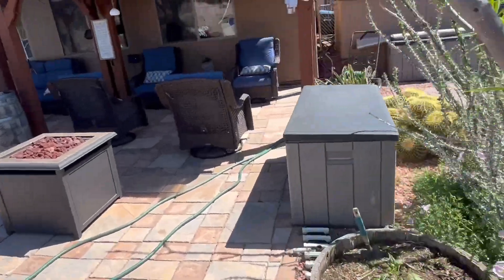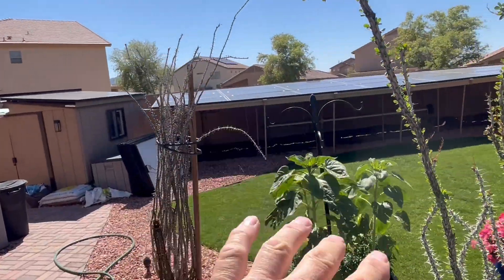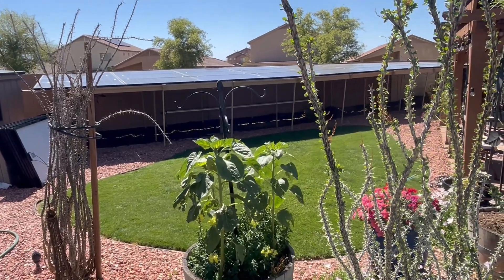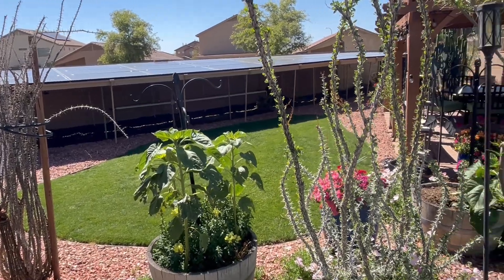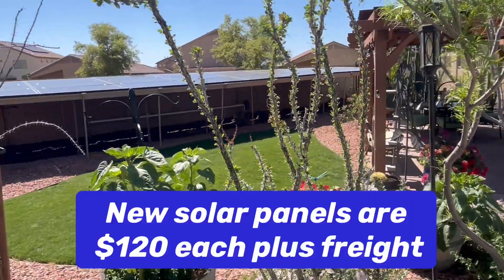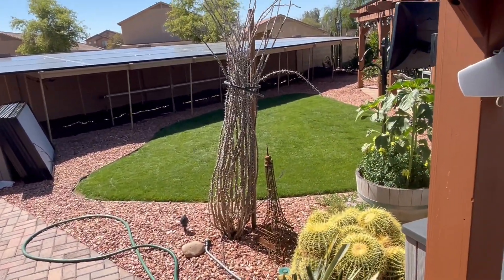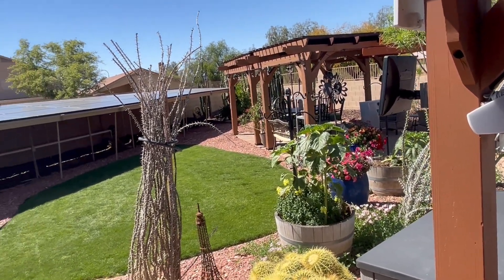Really liking those new bifacials. The used panels I bought over the years were anywhere from $25 to $40 a piece. One of the problems I'm having is water intrusion in them after about 2 to 4 years. With the new solar panels I just put up, I have a slight angle on them, and I'm hoping that slight angle will keep the water from puddling on the panels.